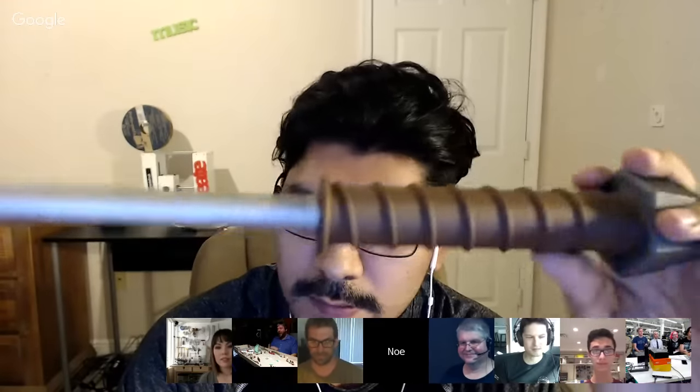Inside the head of the mace is a NeoPixel jewel. So that has 7 NeoPixels. And then there's a wire that goes through the rod. And the handle is all the electronics. We got an Adafruit Trinket and a battery, a 2200 LiPo battery, the cylindrical kind, because it fits perfectly in there. And then I have this nice metal button.